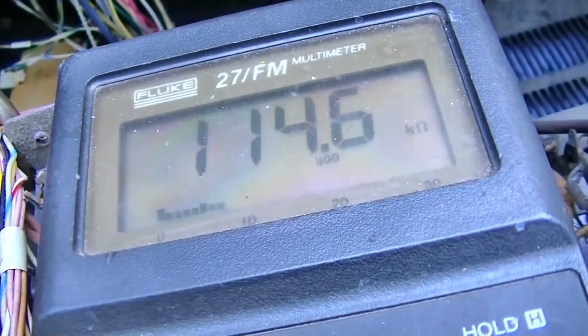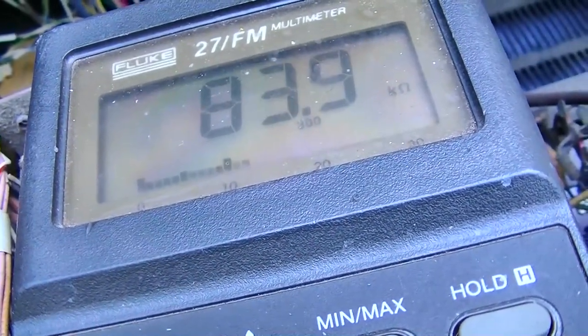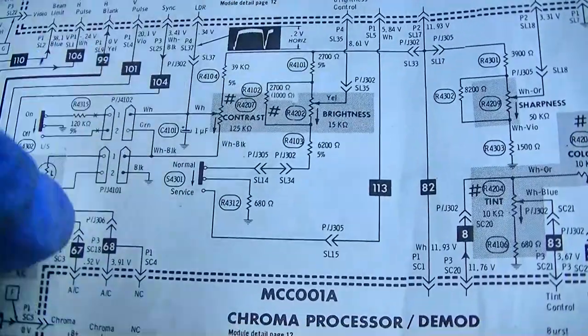The vertical deflection control is very flaky — all over the place. I saw it up to 2 megs. Very flaky. Same thing on this one — I've got it set in about the middle of its range, so neither pot is open. Another thing I'm noticing: the more I get this brightness control cleaned, now I hardly get the flashes at all. Maybe there's another problem with the set — maybe a voltage missing from the power supply. The brightness is tied in with the normal service switch.